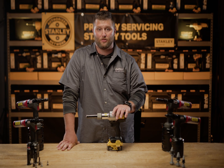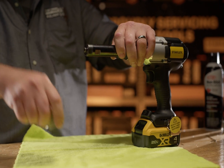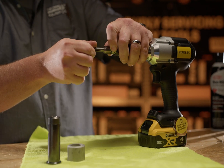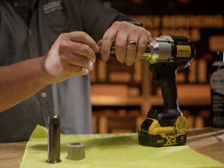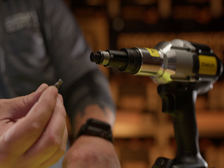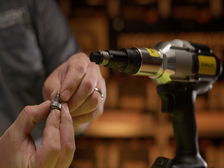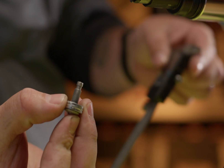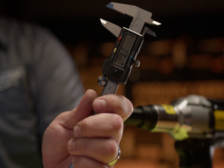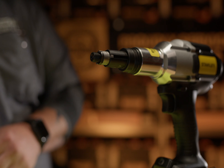Next I'm going to show you how to set the stroke setter. First we're going to remove the nose housing nut, the nose housing and anvil, and then the puller or the collet. Determine your application pin stick-out length in millimeters. I have a set of calipers and for this demonstration I'm going to use three washers as my thickness. Measure the remaining height — the calipers show 17 millimeters of travel. I'm going to refer to the manual on page 11, which tells me 10 clockwise rotations.